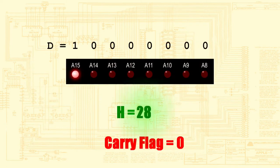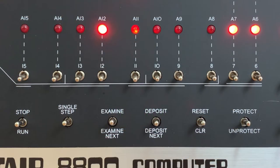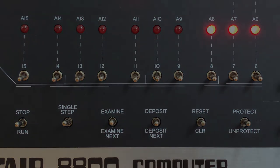In other words, the single state of the lights is displayed repeatedly until the flag is set. And the bigger we make the interval, the longer the CPU will continue to display the same light. The longer each light is displayed, the slower the lights appear to move. Once the carry flag is set, the next statement is executed.